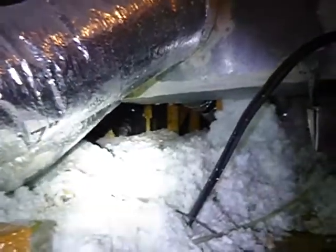Loose fill fiberglass insulation. Those are mouse trails running through there. Those are mouse houses. At one time we had soffit baffles around here to bring air into the attic. We no longer have those because we've added this radiant barrier. We're not supposed to have more than ½ inch sag. That's it. Got better examples.